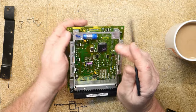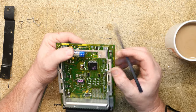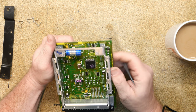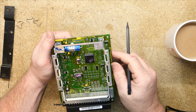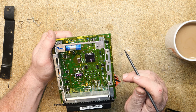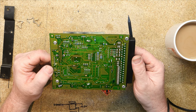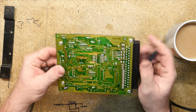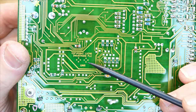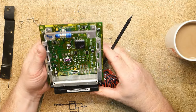We've got another chip that's missing — just in here — which I would guess is a serial EEPROM based on the pinout. I'm not quite sure; it's possibly something that got removed in development because they felt more memory was needed, or it means that certain features were deleted from this. And we have a copyright marking — copyright Lucas Industries — with a date. So I don't know what the Dunlop connection is, other than the airbags.